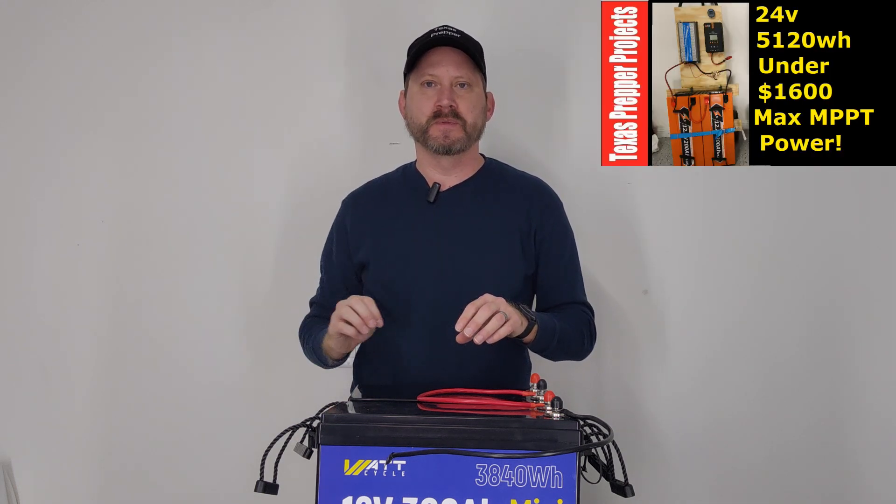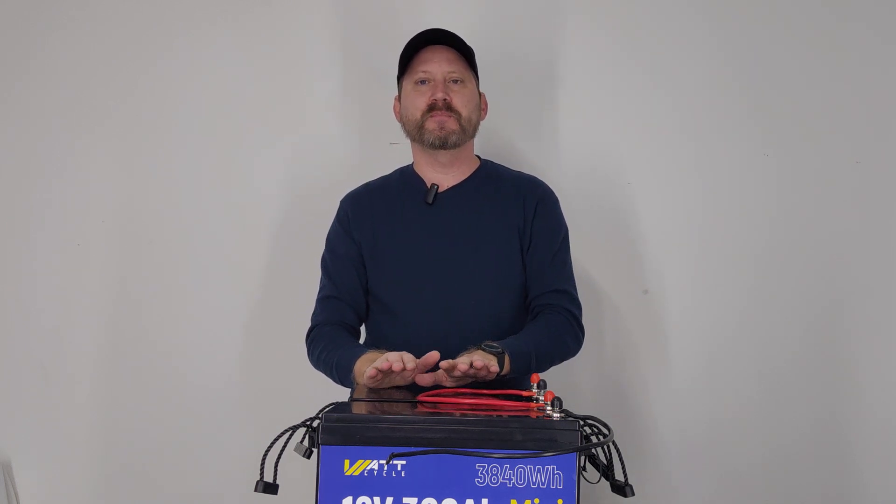Now let's talk about getting power out of the batteries. On a 12-volt system I use the guideline 10 to 1: if you're pulling 1,000 watts out of your inverter, you're pulling about 100 amps out of the battery. On a 24-volt battery system that number gets cut in half — pulling 1,000 watts only draws 50 amps out of your battery system. Since these batteries are rated to a 200 Amp BMS, you're actually doubling the total system power you can pull. You can use a larger inverter — wired as 24 volts you can get over 5,000 watts out of this system because the current went down.